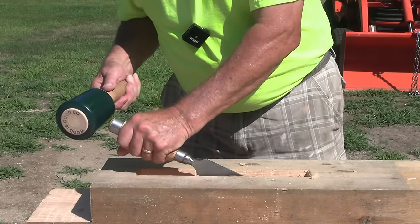That's end grain, and that end grain is going to be hard as iron. It's nice and flat, but that end grain is hard as iron when that meets up with the dovetail, which is the length of the grain. That's going to compress a little bit with the driving of the wedge in at the top. And it's going to be a hardwood oak wedge. That's 2 by 1.5, and it's a long wedge that will be driven in and then cut off at each end. So that's it, and I'm going to continue to load up another post, and we'll continue and start laying that one out.